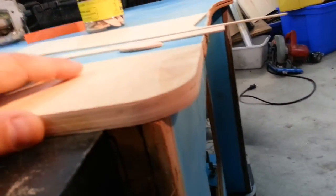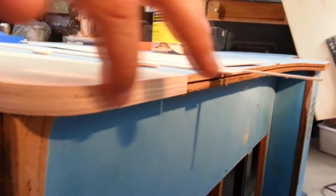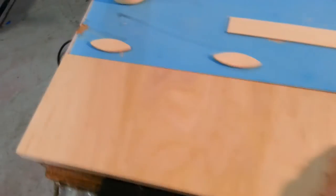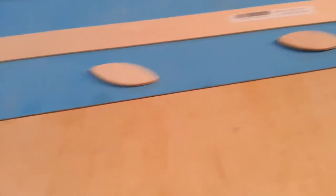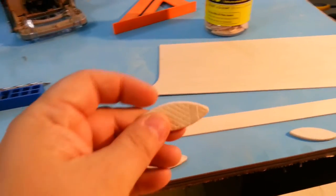So that's a unique solution to the nine-sixteenths Nintendo problem — as you can see from the front it matches up pretty perfectly. All we'll have to do is cut the new t-molding down once we join it together, and bondo the seam. Since we did such a nice straight cut, bondo is going to be pretty easy — just that little crack and feathering it through. The next step is to biscuit join this piece of wood to the cabinet. I've laid out number ten biscuits here — Ryobi, but any brand follows the same standard. I use number ten on plywood and we'll use the biscuit joiner right here.